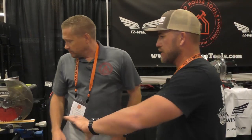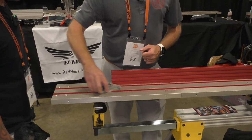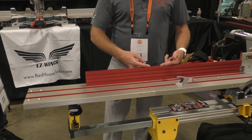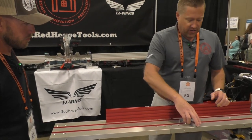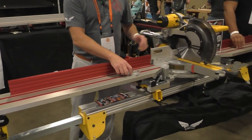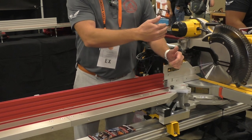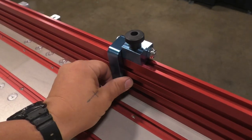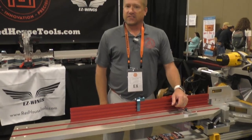Does it come with stop blocks? It doesn't, but we do offer our patented stop block system — it's indexed with hard stops at 45 and 90 degrees. You can slide it in and out of these t-tracks, which are standard Rockler profile, so it accepts any standard stop blocks. Same thing with the back fence — it accepts any flip-down stops, measuring systems, jigs, and angle gauges. The stop block is cool because it works at 45 or 90, or you can use it as a crown cut position. If your miter saw only swings to 45 degrees, setting this block at 45 and the saw at 15 or 20 gets you to 60 or 65 degrees already.